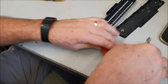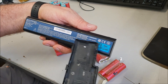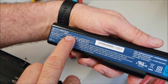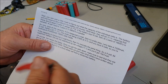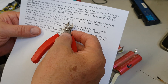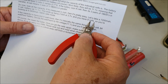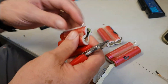You might want to keep the label because it tells you the specs. This one is 4000 mAh and 11.1 volts. It says here that at 11.1 volts you'd get 21,600 mAh at 3.7 volts if you have nine cells — we've only got eight cells, so you'd have to do the maths, but I'll put that in the link in the description.